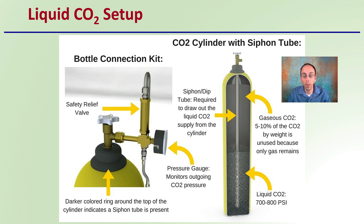We have the liquid carbon dioxide at 700 to 800 pounds per square inch. Looking at this in general, it's very similar to a compressed bottle in a gaseous state. But as we saw, additional equipment is required and it tends to be used in larger sizes for larger operations, where simple compressed bottles would just be too laborious and not as efficient.